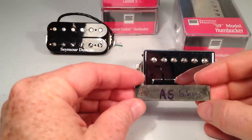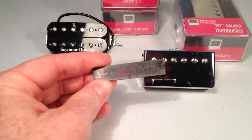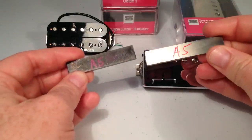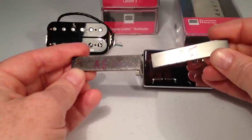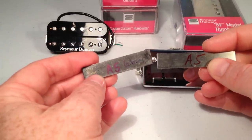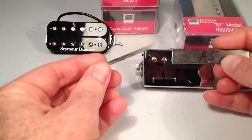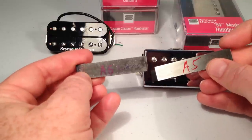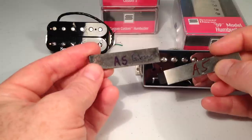And finally here we have another A5 magnet, but this one is a rough cast A5, and there's a difference between that and the smooth A5 we looked at before. If you look at the one that we've already seen, how shiny and smooth it is, and then if you look at the rough cast, it's almost like it was sand cast. It's got a lot of pits, a lot of little bumps in it, and that actually matters. It doesn't make a huge difference in tone, but it can make a significant difference if you're just looking to shave off a little bit of annoying high end from a pickup. It kind of smooths out the high end but has all the same characteristics of the A5. If you want to get rid of just a little bit of ear piercing high end, the rough cast A5 — like the one I took out of a Gibson pickup — may be the way to go.